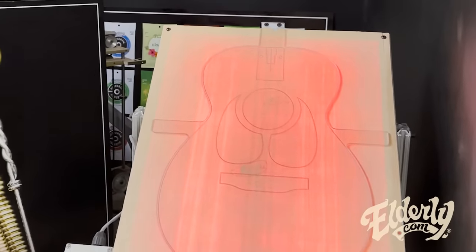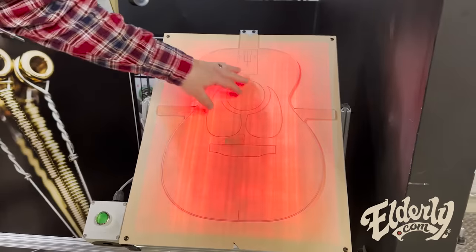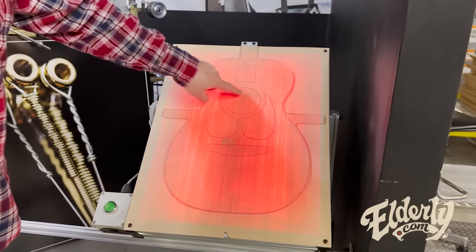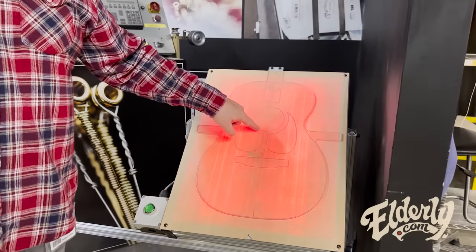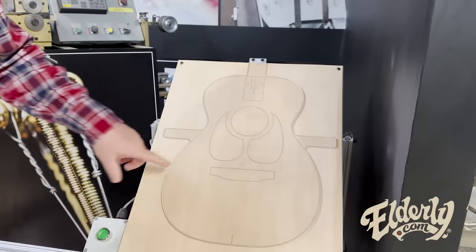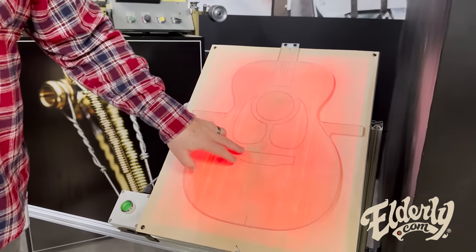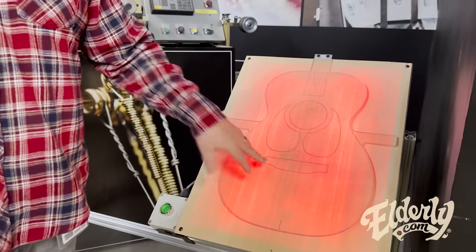Structural flaws in the spruce. Checking for structural flaws, yeah. With the light behind him, the process is called candling. You can see imperfections in the wood, and we have an example here where there's a couple of things. This one would be cut out by the sound hole, so that if it were just that, that would be a passable top.